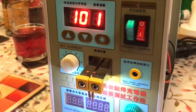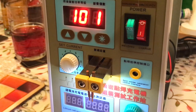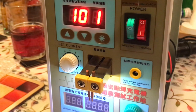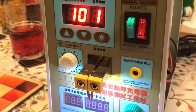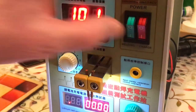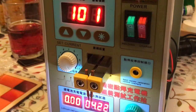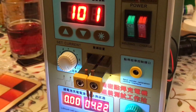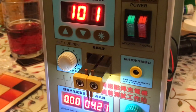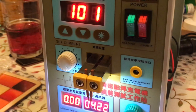It's absolutely working, and I'm quite pleased. I bought it even though I had to do a transformer change - the transformer was free because it came out of a dead microwave, and I've quite enjoyed doing it. What I've got now is a very effective battery welder with its little charger unit built in. One addition I'm going to make is to put some outputs on the side for a probe, so I can use a cable probe for spot welding. I'm really happy - here we are inside the house on a standard plug socket, 16 amp going through a 13 amp fuse, and up to its maximum it doesn't trigger.